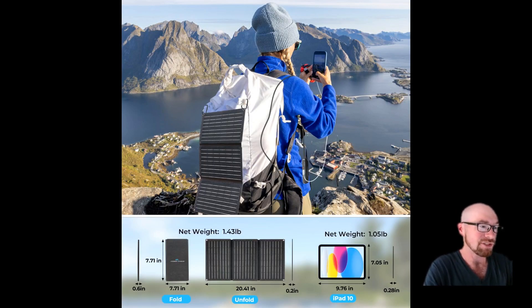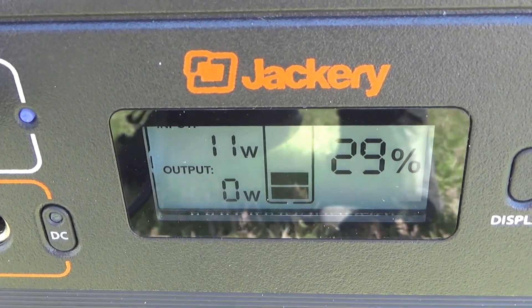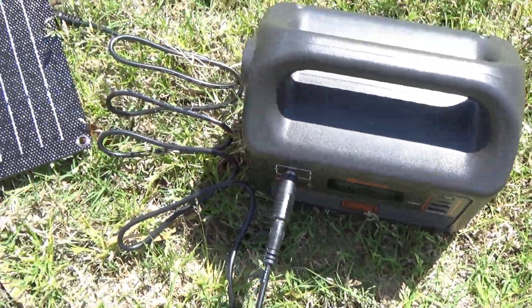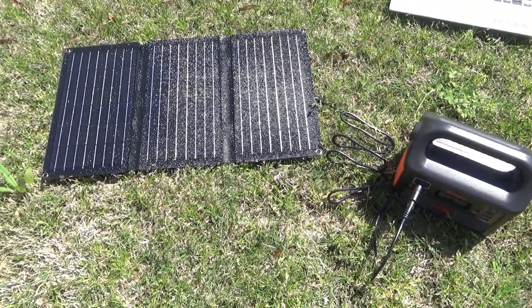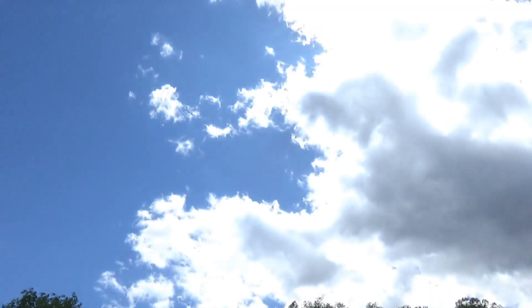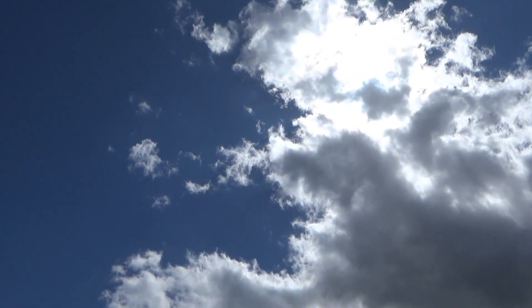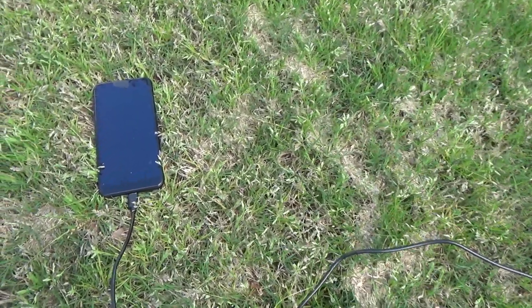With PWM I was getting 13 to 14 watts, and with MPPT I probably would have gotten a couple more watts — maybe 15 or 16. It's only a 20-watt panel, so you're never going to get the rated output. What also surprised me is that just flat on the ground, it was still getting 11 watts. We're in April now so the sun is higher in the sky, but I thought that was pretty impressive. Because this thing has that direct output at 18–19 volts without the control box, you can use it with any power station. The smart chip inside means that when a cloud passes and power drops, as soon as the sun comes back out, it just goes right back to where it was.